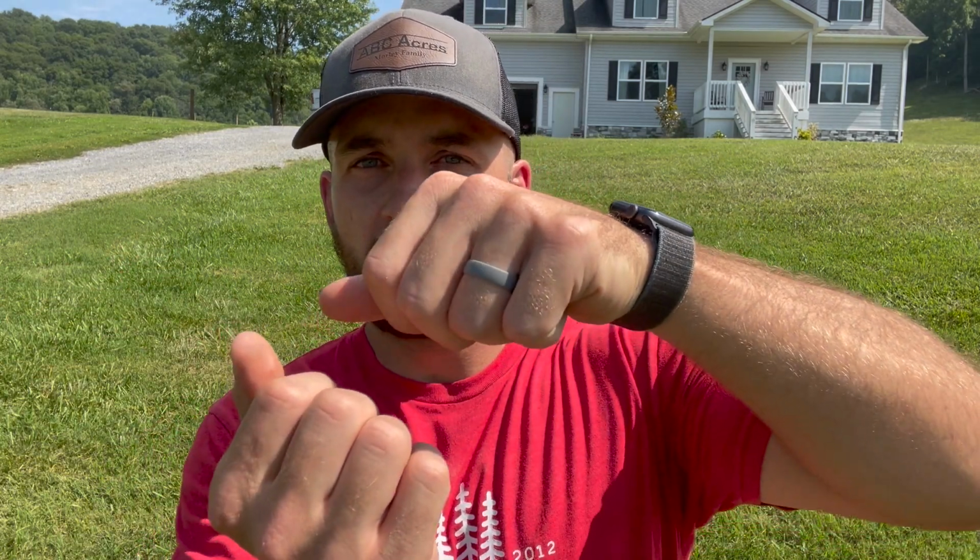The one complaint that I have with that one is the hinge wire. Whenever you're stretching it out down your fence, if you're by yourself, and I was running most of this by myself, whenever you try to stand it up, it just collapses back down like an accordion. So it's hard to get it to stand up against a fence post and tighten it by yourself, because the whole time it's just collapsing on all those hinge joints. So your wire's just folding down in the middle and you're trying to pull it up, stretch it out.